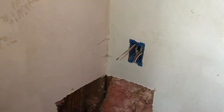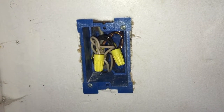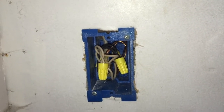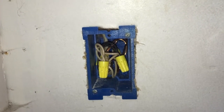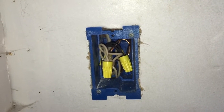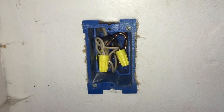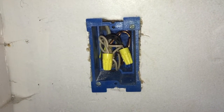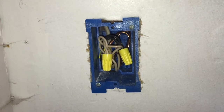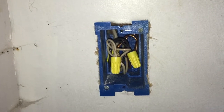This is just a junction box, so I'm going to end up stuffing all these wires in here and putting a plate over it. Here it is all tucked in — not the prettiest junction box ever, but ground wires are stuffed in the back. Double-check to make sure the bare copper ground isn't letting the hot or common wires stick out of the wire nuts and come into contact with it. Everything should be nice and tight and not going to move around.